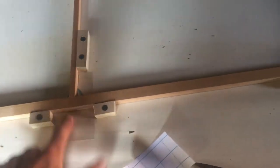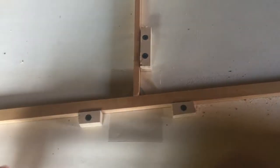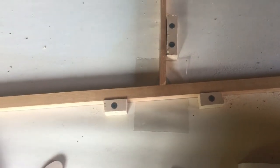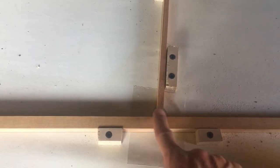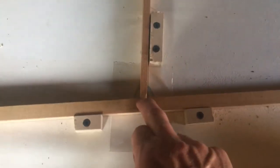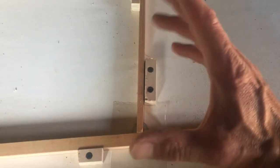My order of thought is I'm going to put some double-sided sticky plastic underneath where my joints are going to happen. Then mix up the epoxy for the wetting coat, which doesn't have filler in it. I'm going to wet the ends of this and the surfaces that need to be glued. I was in a bit of a quandary about how the glue is going to work here, because this is under a little bit of pressure because it's kind of holding the whole structure.